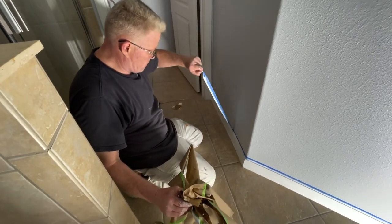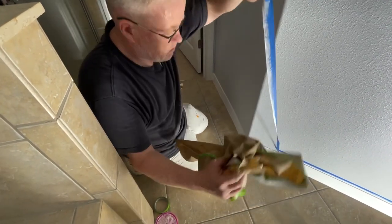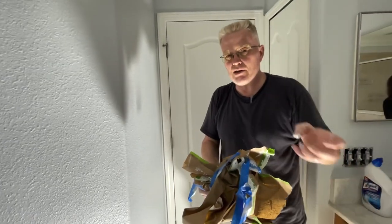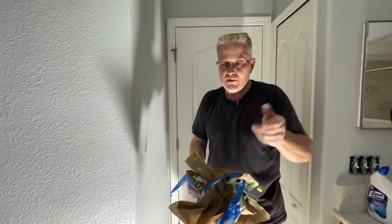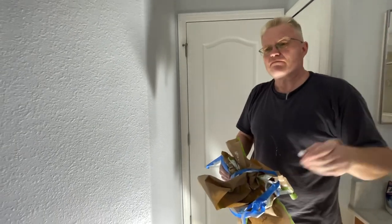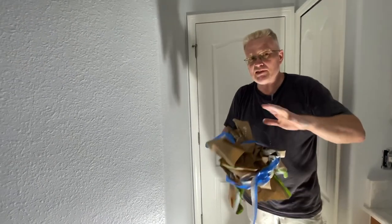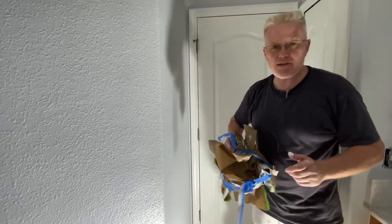I can just see that coming off nicely. So if you want to spruce up your trim, you don't have to paint your walls. Let's say your trim is really grimy, getting dark, people are kicking at it, but your walls look pretty good — tape off your wall, tape off your floor, spend an hour or two, and your whole room will be done. It doesn't have to be a disaster and a big project. It's as simple as that. Let me know how you guys do it and share it with us. Thanks for watching my videos.